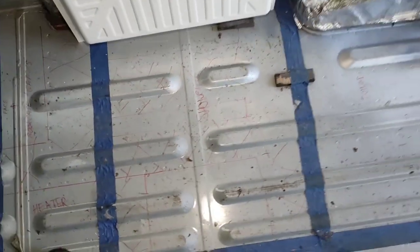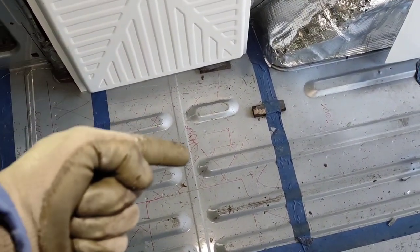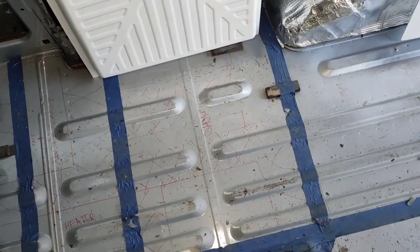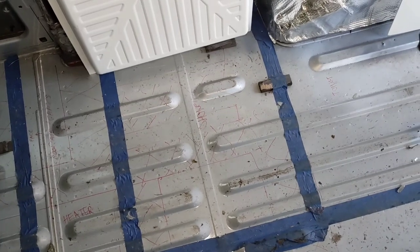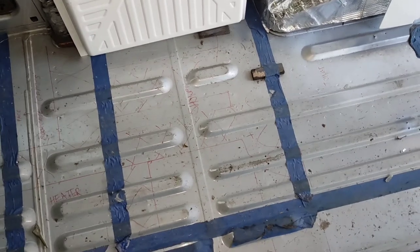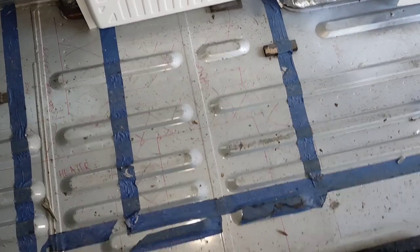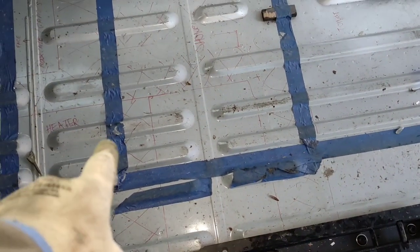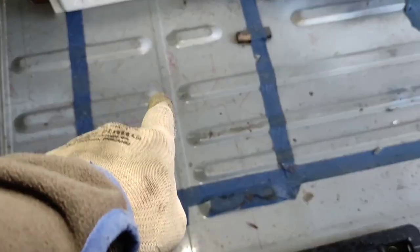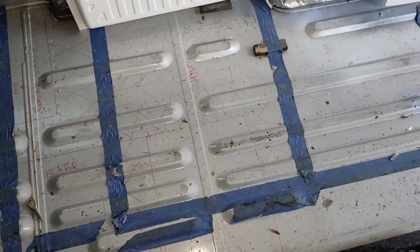So I think what we're going to do is lift the shower tray up and then have an elbow to this area which is clear, and another elbow down through the floor. It'll mean that the shower tray is sat maybe a hundred mil off the van floor, but I think that's okay — we've got plenty of headroom in here. I also need to make sure I can put an access hatch in here so that should we ever need to get under to service that drain, if there was a leak or anything, we can still get at it.